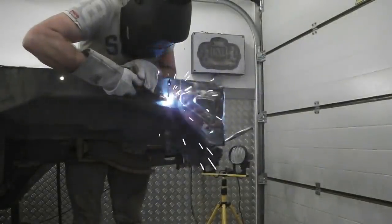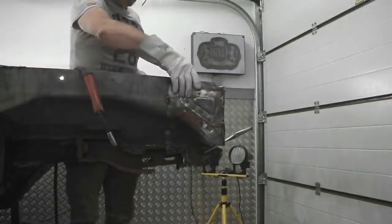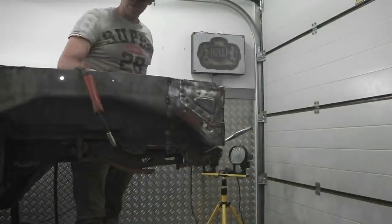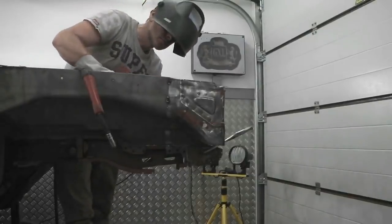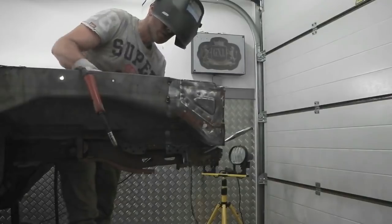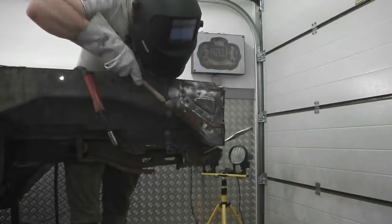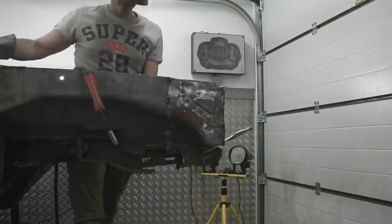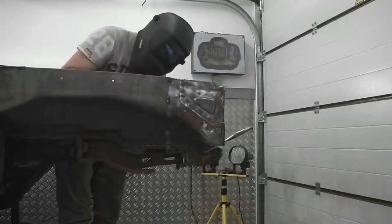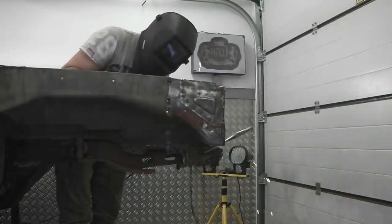We don't put them too close together initially, so that you don't get a warping effect, and it tends to ripple, and you lock that ripple in position with your weld. So you want to space them out, then keep checking and tapping, and close in on the job, and you sort of encircle it and close in until you're down to the fine point and it can't move anymore. And then it's a question of filling in between the tacks. You can even get to a point where you can do continuous weld between the tacks because it's not going to warp. I have the wood underneath here, my patio floor is going to get hit, I know that, but I try and minimise the damage.